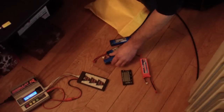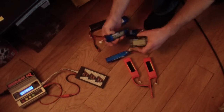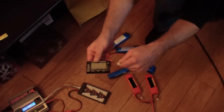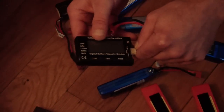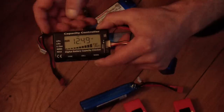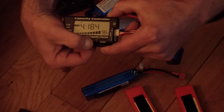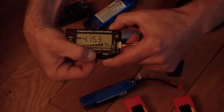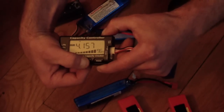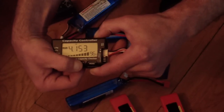When you have a lot of LiPos and sometimes you don't know which are full and which are just finished, you can check with a LiPo checker — this thing here. You can see in my other videos. Here you can see every cell displayed individually: cell 1 is 4.18 volts, cell 2, cell 3 — this is a 3-cell battery.